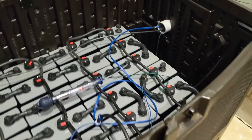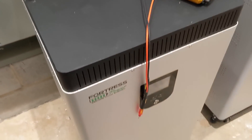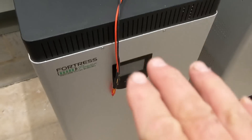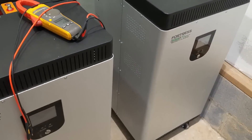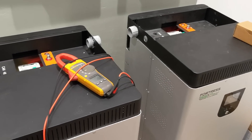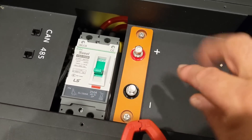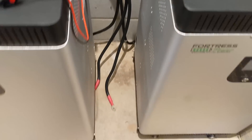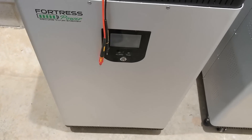I was going to do separate home runs, but I pulled the battery cables out and we're going to use those because we have a bus bar in here that will parallel these. The software in each battery is capable of doing the balancing. I was concerned because one is at 40% and one is at 70%. We don't want any problems when we fire it up. You can see in here a 250 amp breaker, positive and negative, same on both. Here are our four home runs — that'll parallel it up and then we'll fire it up.